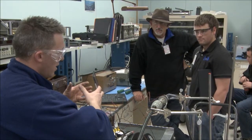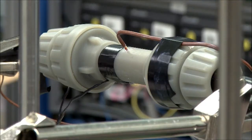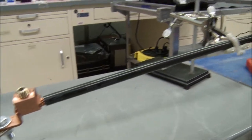for future use. Today we measured 3 different points of temperature: one on the outside of the insulation, center of the connector; one drilled through the connector down to the copper insert, where we measured the internal temperature; and then one of just the cable directly outside of it.